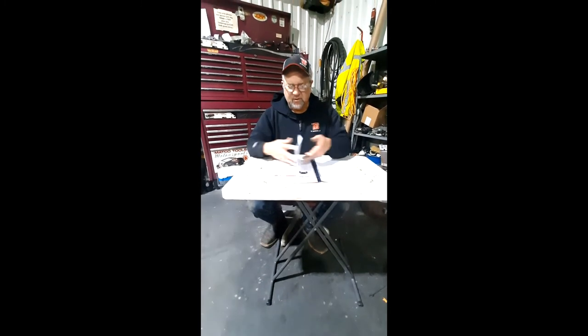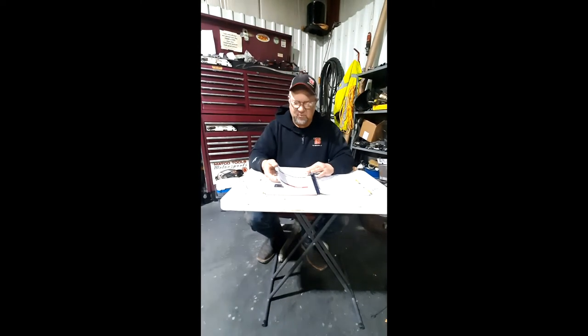It gives you all the specifications for, like, this is for an RDS 550. It gives you the rotation torque, rotation speed in a perfect world, supply pressure, supply flow, hydraulic oil specifications again, grease specifications for a rotary drill. I asked our parts man one time, I says, why is the grease specification in here so many times in this manual? He says, that's because they need to know that, and if it's in there several times, sooner or later they're going to see it.